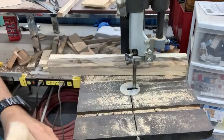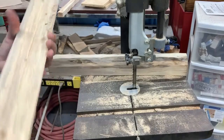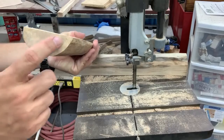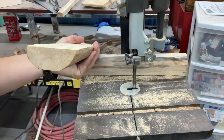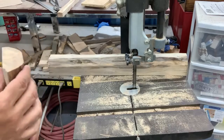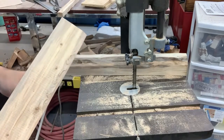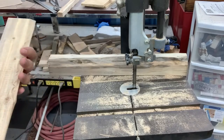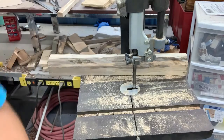This is the side I was kind of wanting to salvage because I already cut the pith out — I'm on that side of it. So that spalting is kind of pretty but I'm not sure it's going to run through it very much. Since I'm putting this on the lathe, I don't need it to be square — I just need it to be straight. So let me get it on the jointer just to make sure it's straight.